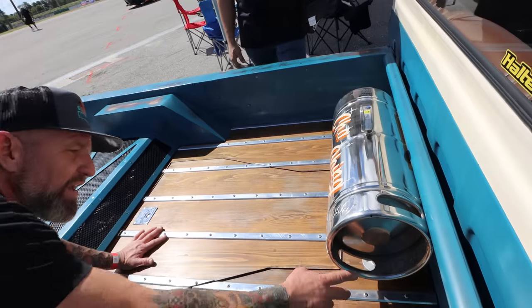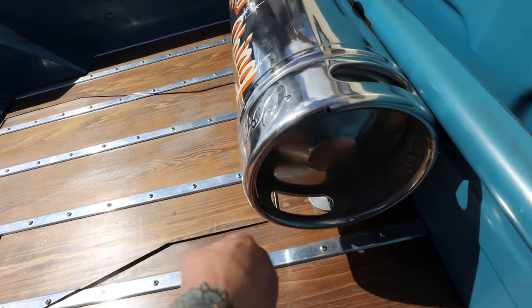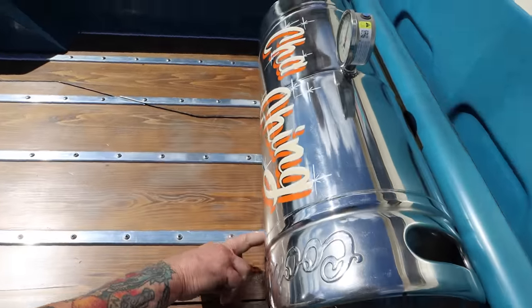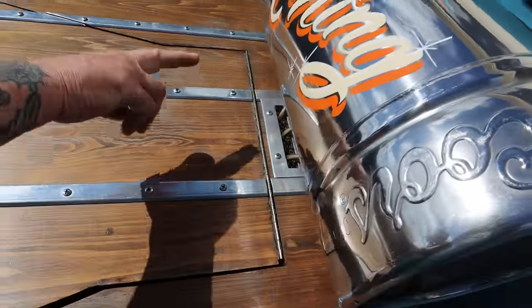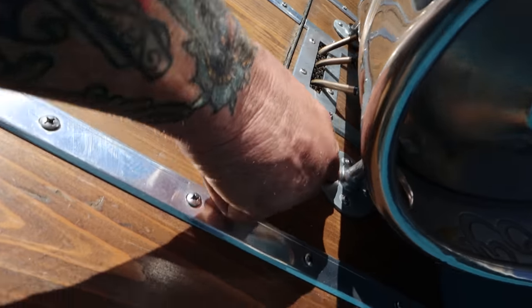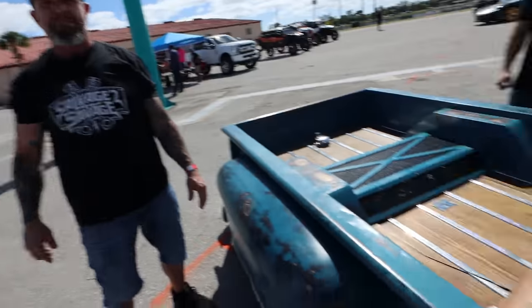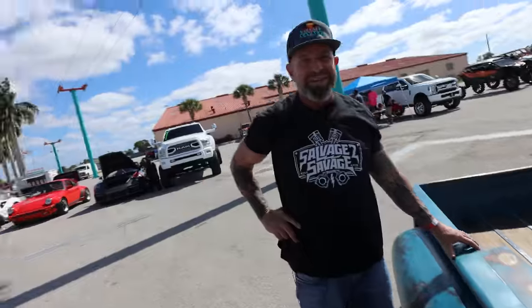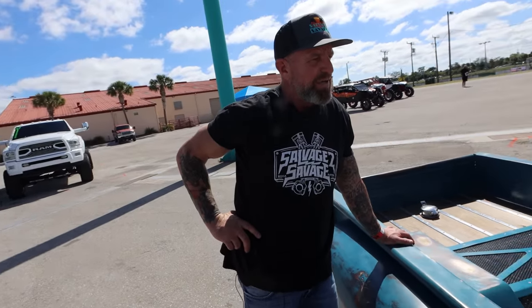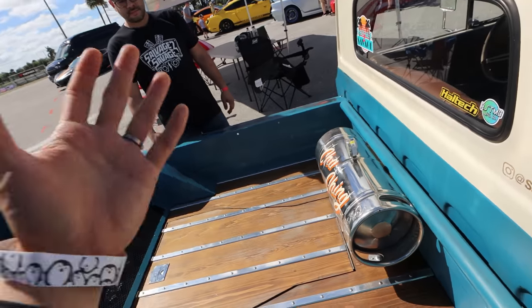Of course. I mean, a typical keg has a spout here. So I welded this closeout panel, and then we welded in the bosses on the bottom. And these are actually the supply lines. These are air lines going to the air management system. And it's the actual mount stand. Yeah, it's a mount and the air lines. So we had to get a little tricky when we were designing that. That is super cool. I just love that so much.